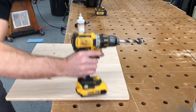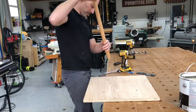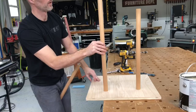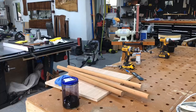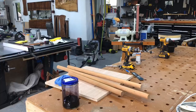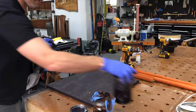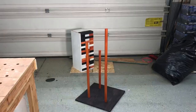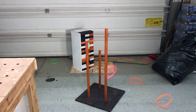You don't have to have threaded inserts — they are pretty handy to have around the shop, but you could just throw a wood screw straight through the bottom of the plywood right into your dowel, and it would be just fine. It just wouldn't be able to be taken apart and put back together as easily. Since I was having a lot of fun with the wood dye for these projects, I decided to keep it going with more orange and black — just wiped it on, threw a little bit of shellac on there afterwards, then threaded them on. This is Ring Toss, and I bought those rings for like seven bucks on Amazon. The game is actually a lot harder than it looks, but I do think kids could have fun building this, putting it together, staining it, dyeing it their own colors, and then getting to play with something they built.